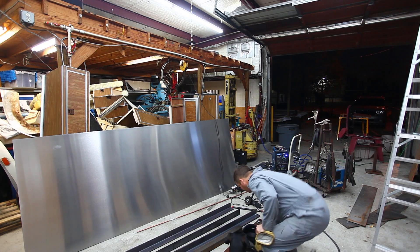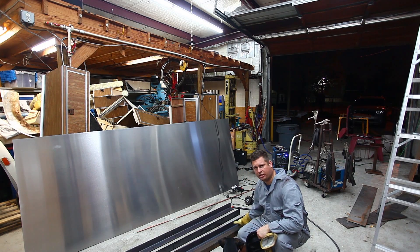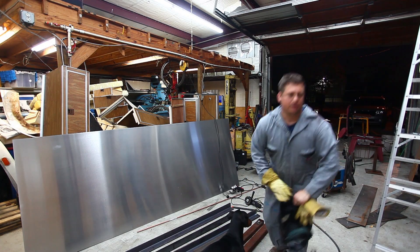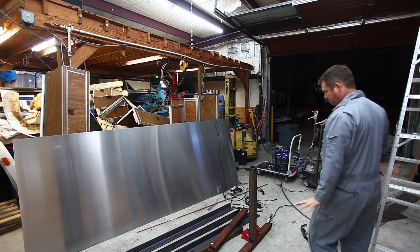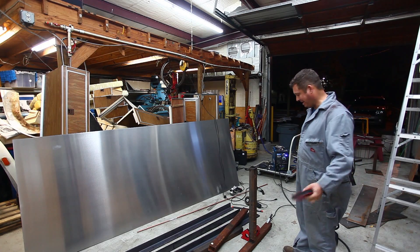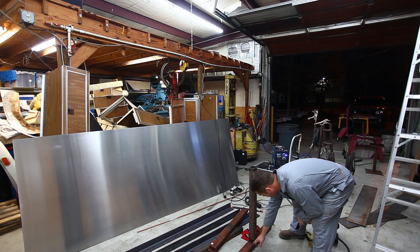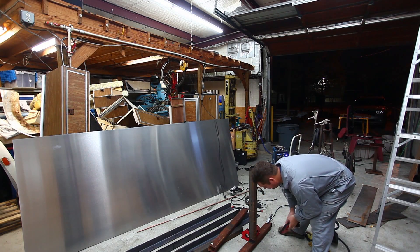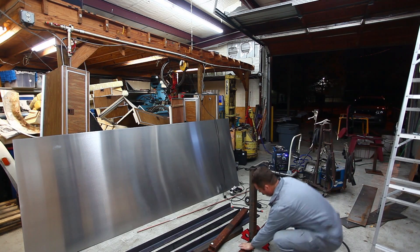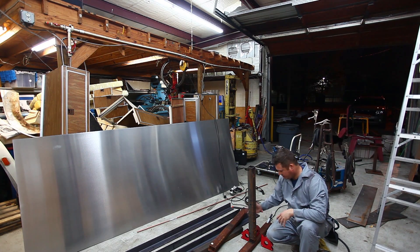These are roughly 33 inches long and there'll be a little bit more material in the back of the leg than in the front. These legs are 31 and a half inches tall. I want to talk about my setup — I'm using some magnetic angles; these make making accurate joints a little bit easier. I've wire brushed where I'm about to weld to get all the scale off. I'm using one on the side to keep this stable and one back here to keep this square.